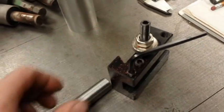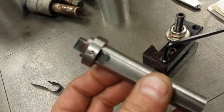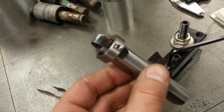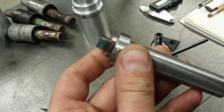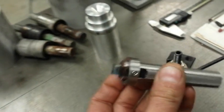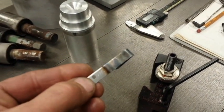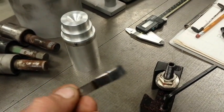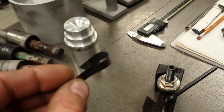I just removed it off the tool holder. If you look at it, I took a three-quarter inch shaft, which I machined a flat on two sides and slotted it. I did a collar here with two set screws on each side. This is basically an exacto blade — one of those break-off blades used for cutting. This one I practiced on; it's got a half inch diameter.